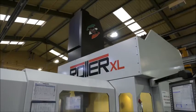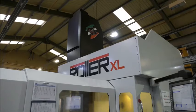Now this is a bridge style machine with the C-axis and the tilting head, and you've got lots of capability with this machine, and you can actually rotate the head to get a different perspective on the component. Is that correct, Graham? That's correct, and what's really clever in the way this machine's been set up is that it's primarily an A-axis tilting head. That is, it tilts about the X-axis, which is the longest axis. Now, unfortunately, the plane that it tilts in is the shortest of the X and Y.